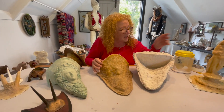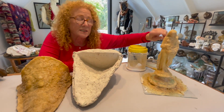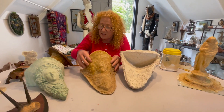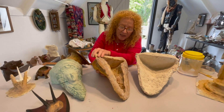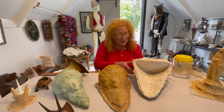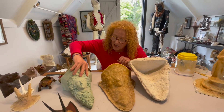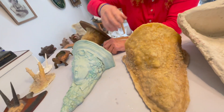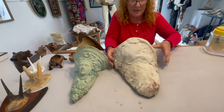It's very easy to do a latex mould — very easy to brush this on 10 times. If it's a hot day you'd be able to do two layers in a day, cold day about one layer. I've come to 10 layers and you have to start thinking about supporting it in the mother mould. To keep it simple I just wanted to do a one-part mother mould. The problem was that it actually has an underbite and cuts in here, so because it goes in it means I would never be able to pull this out in one piece.